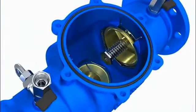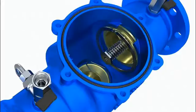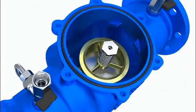Press clamp on outlet check valve together and remove it from the seat. Twist securing ring out of the seat groove. Remove check valve from housing.